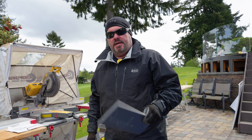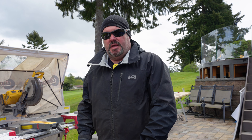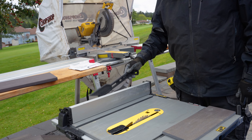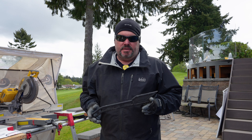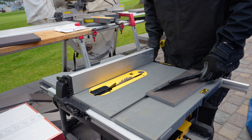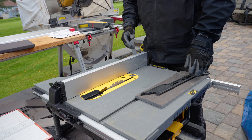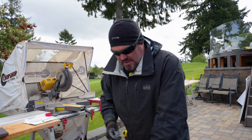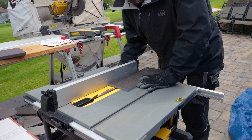The next item is probably the most important thing you need to know about a table saw — safety. Mine is on board, sitting right next to the fence. It's called a push stick, and these are the most underrated part of a table saw. That yellow zone near the blade is the danger zone. If you have to get your hands anywhere near that area, always use a push stick. I have a $25,000 thumb — I could show you why you don't want to use a finger as a push stick. I know several people who did not use push sticks and maimed their hands.